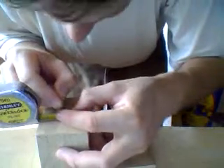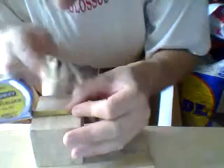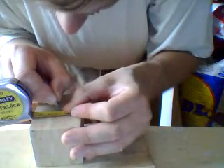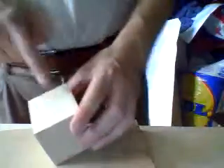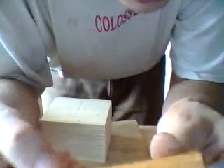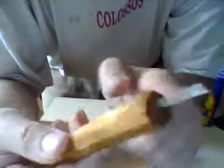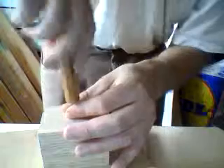We have to work now very accurately, because once you are drilling it is too late. I marked 28. Now we just turn it and mark the 28 at the other side as well — only out of curiosity, to see if the drill piece was square. So we have now marked our place where to drill. Then I take my self-made punch, which is just a nail in a piece of beech wood — I inserted the nail, removed its head and filed it into a point using a harder kind of nail. Then we punch-mark our pre-mark so that the drill bit will find its place easily.